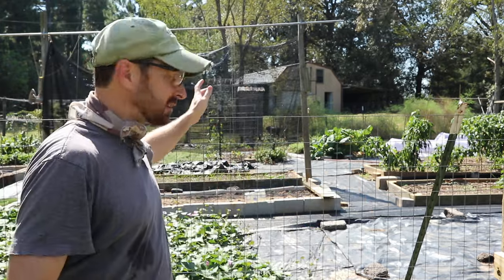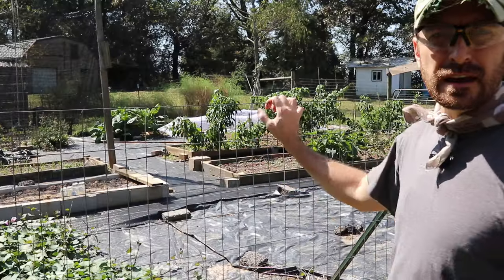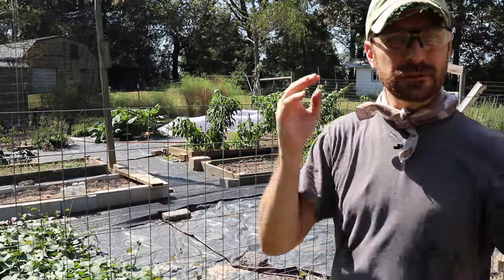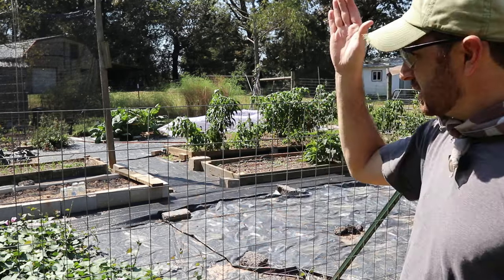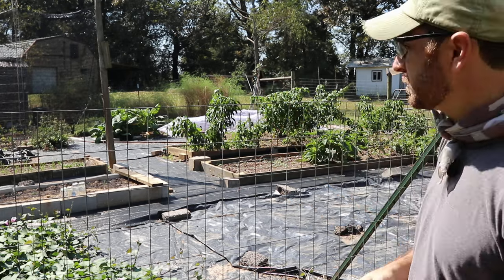Let's get moving and cut through our fencing — makes me nervous, but we need to do it. We've already got two T-posts set in the garden holding up the fence, but they're not spaced properly to receive the tube gate. So we're going to have to drive two more T-posts, but first I need to cut this wire fencing straight down the middle between the two existing T-posts.